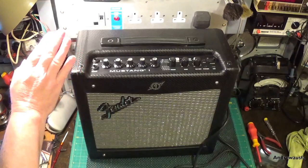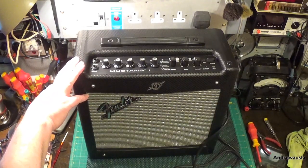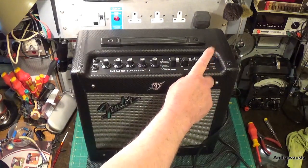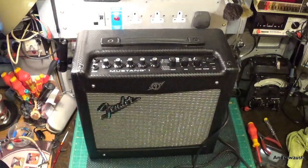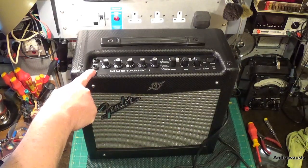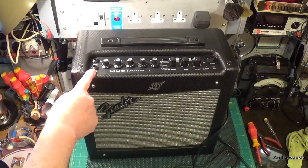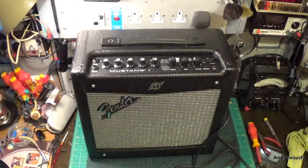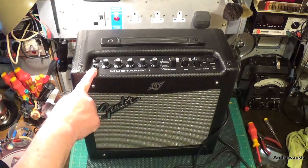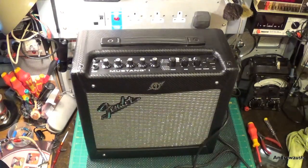That was last night. This morning I had a look on some guitar forums and the jack plugs on these seem quite a common problem, along with the headphone socket as well. So we're going to open the amp up and have a look at the jack plug. It's mounted on a PCB, it's plastic which is never very good, and it's probably got lead-free solder which is bound to crack and go nasty. We could have a loose connection or the spring contacts could have gone inside the switch. I do have spares in stock, so let's crack on and get the amp open.